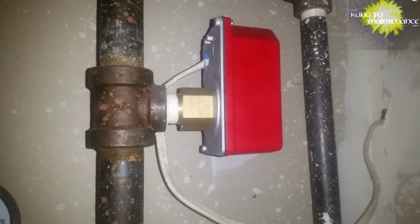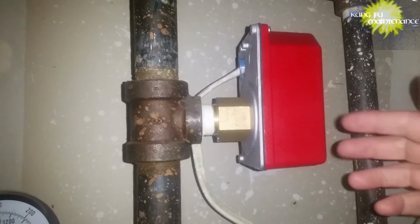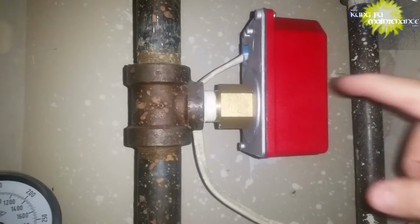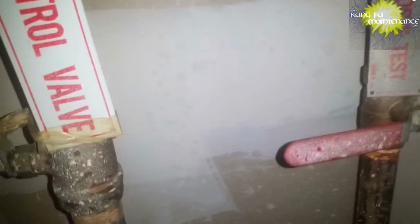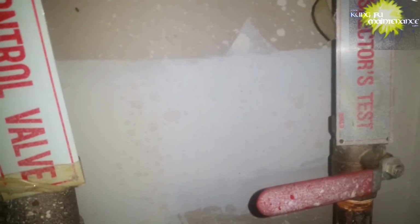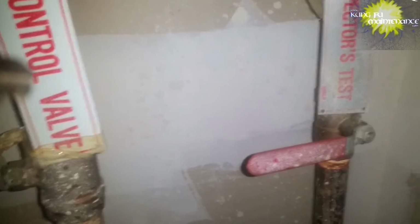But anyway, this was just a primer discussion on fire sprinklers and what's required. Now for commercial, you can't flush them yourself. You actually have to hire a company to do it, and there's an annual test, and then there's a 5-year test on the sprinkler heads themselves, which goes into much more depth. I touch on that a little bit in a few different videos about making sure that when you have painters paint, they're not getting any paint on the sprinkler heads.